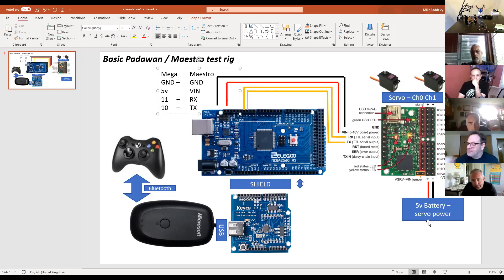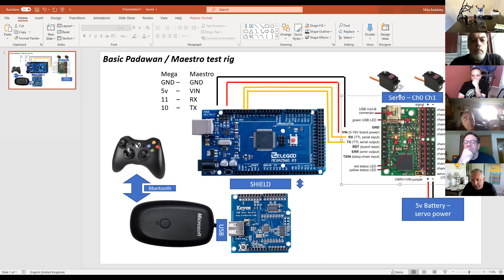On the Arduino Mega I've got three serial ports - serial one, two, and three - but you can also run Software Serial, which allows you to run serial ports on a number of other pins. The Maestro literally just sits there; it's a one-way communication where the Arduino transmits commands and the Maestro receives them. It can't give feedback without the other wire connected, but it will still behave and do the commands. I tend to connect the two because then I can use the more advanced features that give feedback. So four wires, pretty simple.